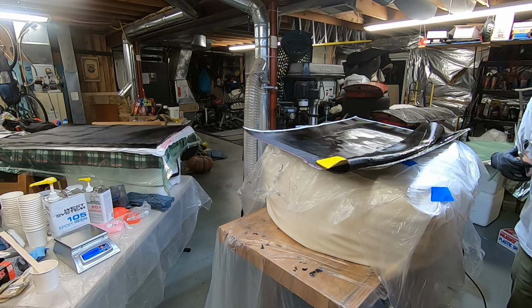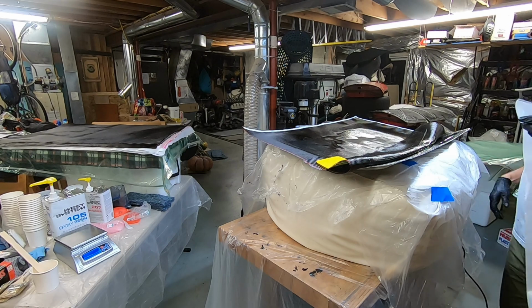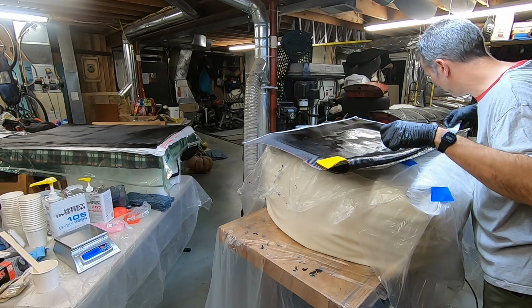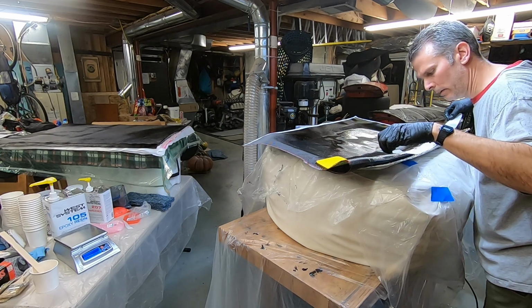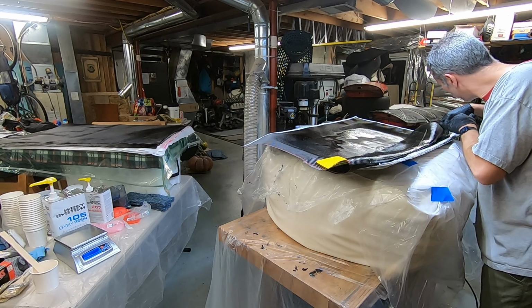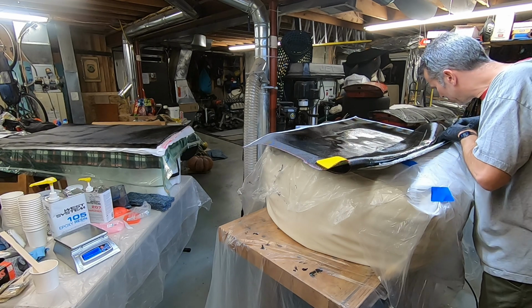because it's still subject to pressure. I think over time it might bleed through. But I think because this fiberglass is less harsh of a weave, it's a gentle weave, I think it'll act like a snowshoe basically and keep the carbon from pushing through. Just want to position it so that it's not going to show.